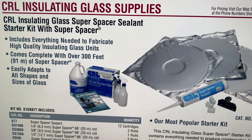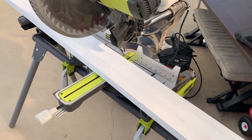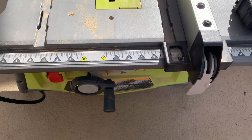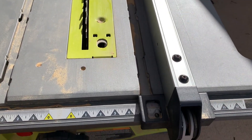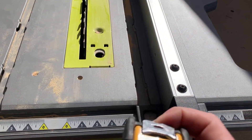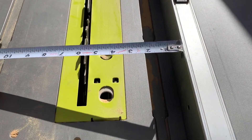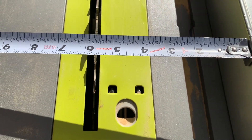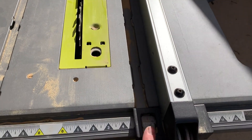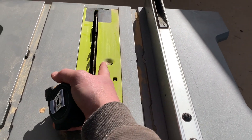They shipped really quick, the prices were good, and the shipping was only about $20. I've got some standard pre-primed one by six, eight footers — plenty of extra length. One thing I wanted to mention: my door frame is four and five-eighths of an inch wide. If you have a table saw, the measuring tape gets you close, but I've found they're always off. So I always set it for what your measurement on the table says, and then literally just go against your fence and measure to the actual tip of your blade. That's a really good way, if you're working with trim or anything like that, to get it as perfect as you can.